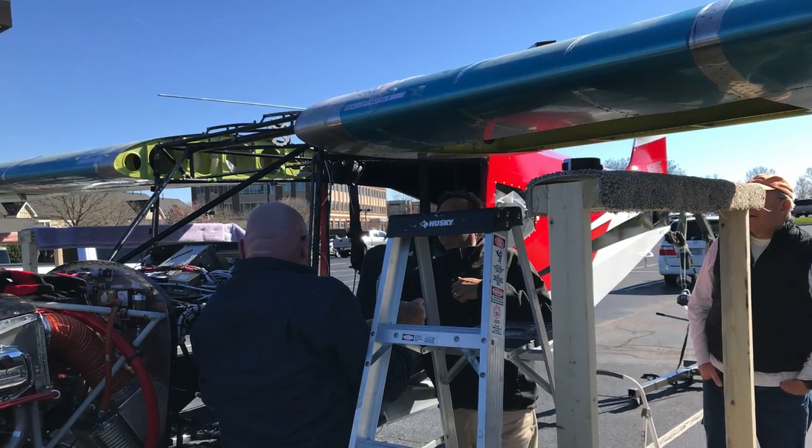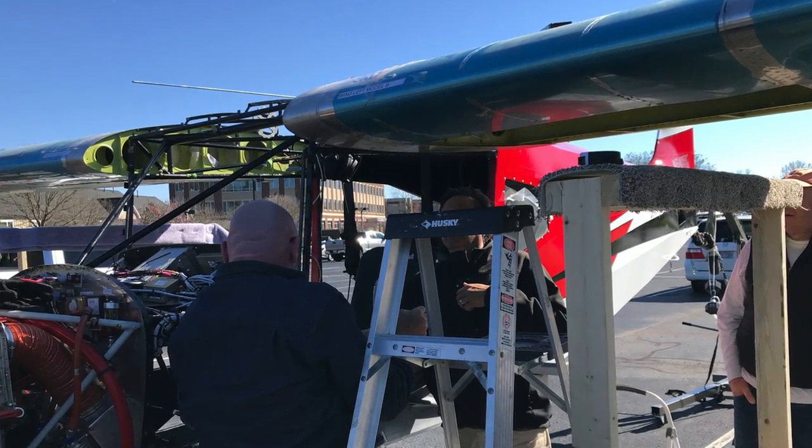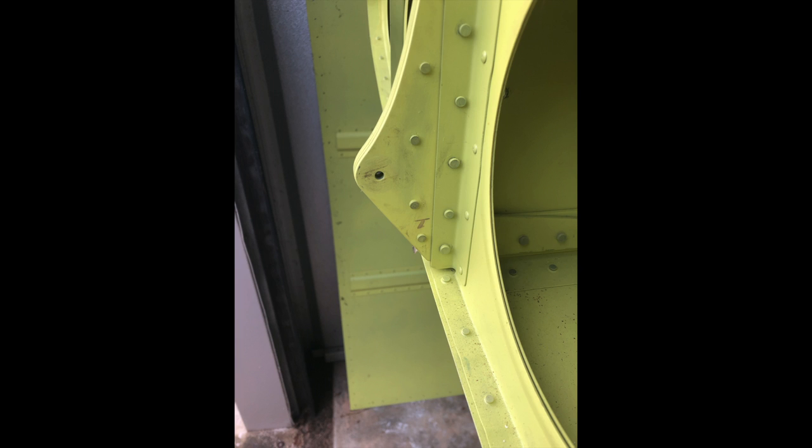So what do we mean when we say we're drilling the wings? We're not actually drilling holes in the wings. What we're trying to do is temporarily mount the wings to the fuselage and match the angle of incidence on both wings — we want it to be exactly the same on either side. We're attaching the spars at the root end of the wing to the attachment fittings that are already prefabbed onto the top of the fuselage. The spars are pre-drilled to 3/16 of an inch and the holes in the attachment fittings on the fuselage are drilled to a quarter of an inch.